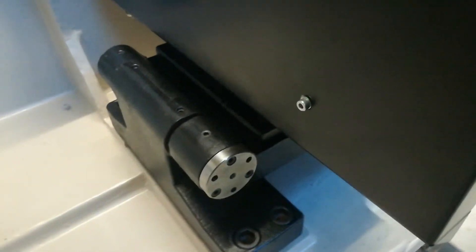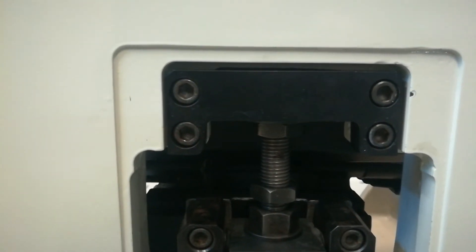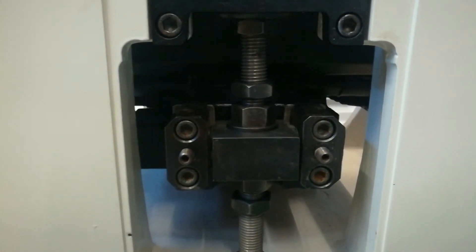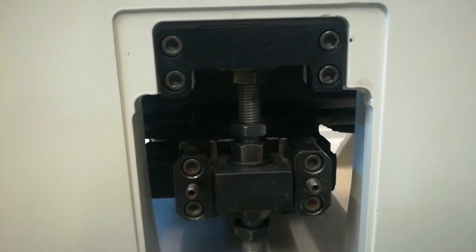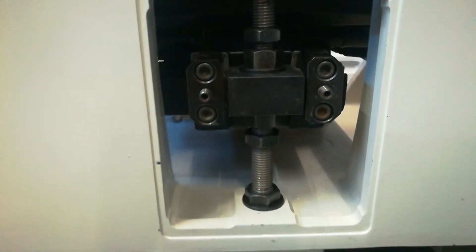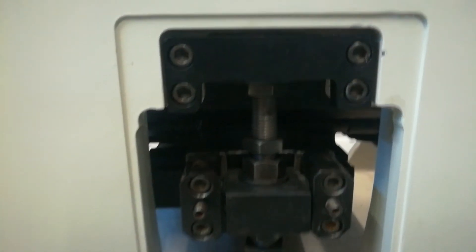You've got the adjustment screw around the front - just taking you back around so you can see this heavy duty unit. All the threads have been reamed - that's the thing, it just takes so long to clean out all those threads from the blasting and painting. I probably spent about an hour just putting this section back in because I'm reaming the threads, cleaning them up on the wire wheel to get any crud out, chasing out the thread and then pasting it up with anti-seize. Same thing with all these bolts - they've all got anti-seize on them.